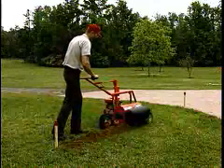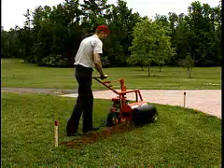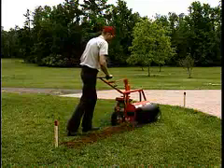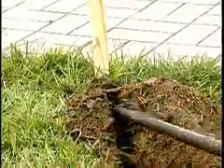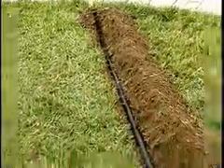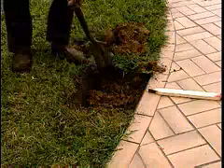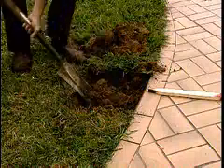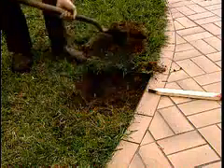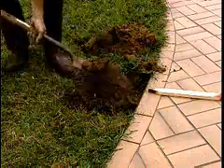As with the dry boring attachment, the starter trench will guide the drill as it passes under the pavement. A close fit with little room for the bit and pipe to move will assure a straight bore. Lay the bit and pipe into the starter trench. Determine the point on the opposite side of the pavement where the drill will exit, and dig a short trench to accept the drill as it passes from under the pavement.